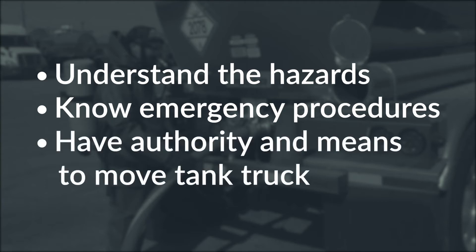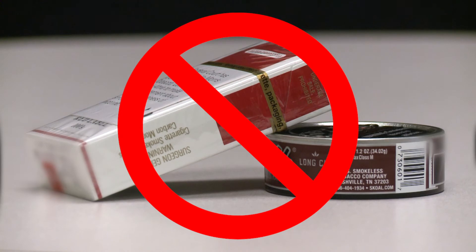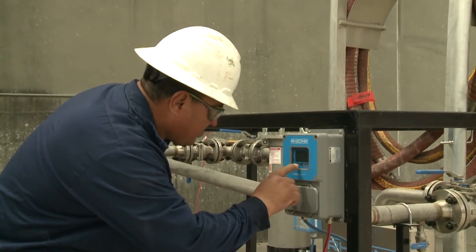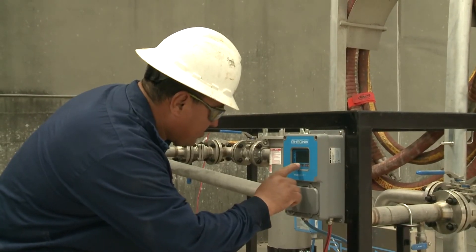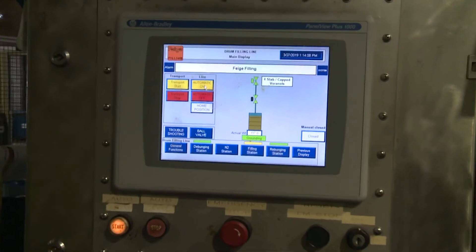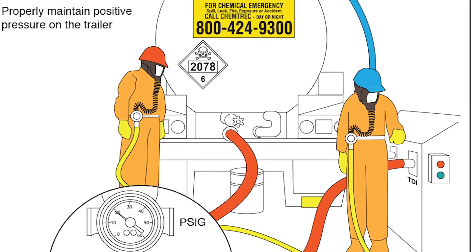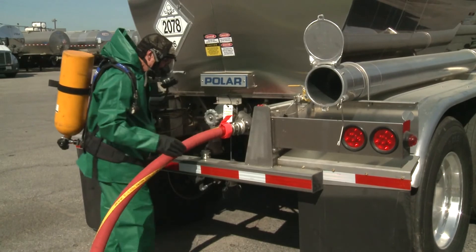The qualified person must know the procedures to follow in an emergency and have the authority and means to move the tank truck. In addition, follow other safety precautions, such as no smoking, vaping, or use of tobacco products, no eating, and no drinking in the area during the transfer process. Monitor the amount of product being transferred at all times. This can be accomplished using an inline flow meter, by watching the tank truck weight if there is a truck scale at the unloading station, or by monitoring the level rise in the storage tank. Using two methods of level measurement increases safety and reduces risk of overflow. Don't rely on automatic shut-off systems to stop the unloading process — such systems are not foolproof. There is absolutely no substitute for an attentive operator.